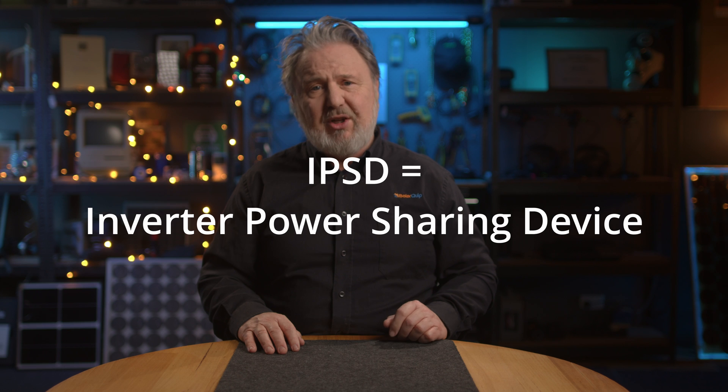We've come up with a definition for a new sort of product — it's called an inverter power sharing device. Something that allows, say, a block of flats to share one PV system with one inverter or one group of IES inverters. The definition in 4777 Part 1 now covers what we call IPSDs — inverter power sharing devices.